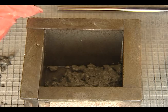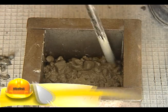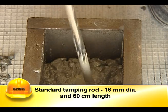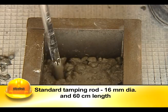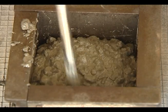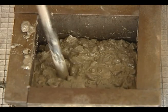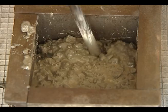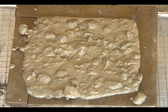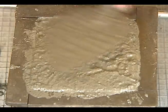The cube is filled with fresh concrete in three layers and compacted well using a standard tamping rod of 16 millimeter diameter and 60 centimeters long. Each layer should be compacted with 35 blows. The tamping rod should enter the previous layer while tamping the subsequent layer. After compacting the top layer, the surface is made flush with the edges of the mold using a trowel.